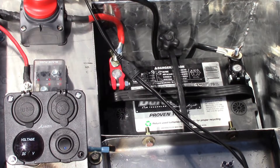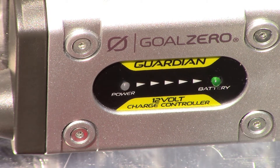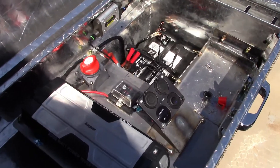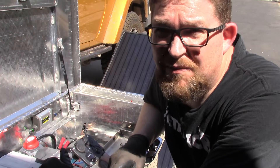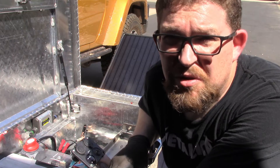My baseline voltage in this battery is 12.6 volts. Let's see what the solar panel does. You get a slow green blinking light over there on the power, which means that the solar panel is charging the battery — 12.8 volts. This is going to be great to charge cell phones, RC trucks, video cameras, you name it. I wanted to make that charge controller a more temporary mount inside the toolbox, because if I'm off camping and I don't have the trailer with me, I may still want to take the charge controller and the solar panel to charge the Jeep's battery. Multiple applications here. In just the brief few minutes that I've been sitting here with this connected, I'm already up to 13 volts. So I'm sure this is going to do the job.